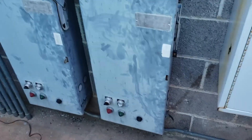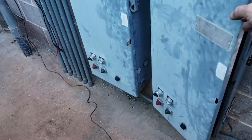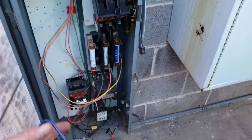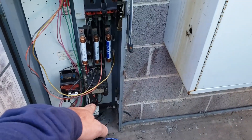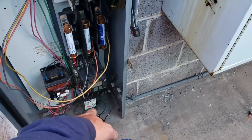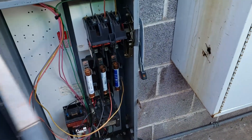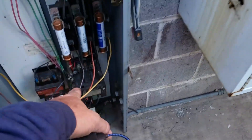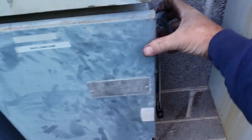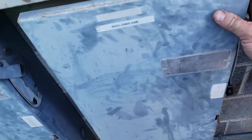When summer sort of ended — which doesn't happen very often here in Phoenix — the water supply over-cooled because one of the tower spray pumps would not stop running. Found out why: the starter took a crap, so they took the pump wires off the bottom of the overload underneath the starter and just hooked it right up to the fused outputs that did go to the starter contactor. So any time that disconnect is in the on position, that pump runs non-stop and wasn't able to switch off once it satisfied temperature.